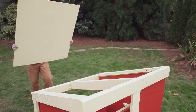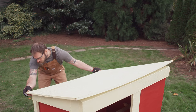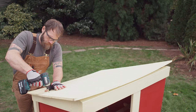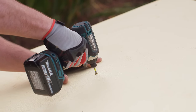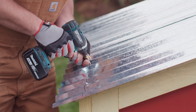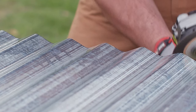You can now move your coop outside to complete the assembly. Place the roof panel on top of the roof, leaving a two inch overhang on each side and three quarter inch on the front and back. Attach by driving screws into the two by fours that surround and bisect the roof line. Finally, cut the roof panel in half, then place it over the plywood, making sure there is an overhang, and secure with roofing screws. Use an angle grinder to round the corners of the metal roofing panel.